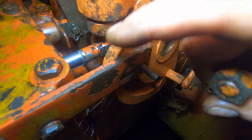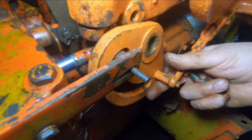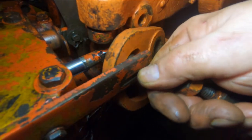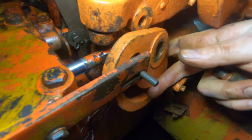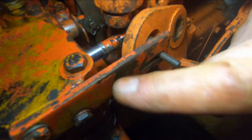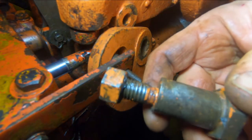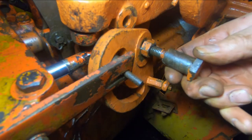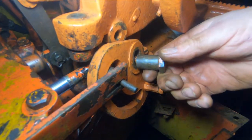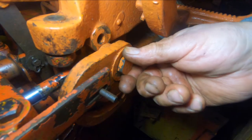The next thing I've done is taken this cam and slid it over onto the little bearing on the pin that sticks out of the flow valve — I just stick it over here. It's loose right now. I put this little bracket in here with those two bolts and got that bolted on — that's the guide. Now I'm going to put this bolt in — it goes in that hole between here and that other hole — so I'll take the nut off and feed it through.